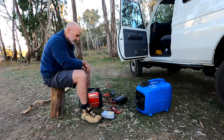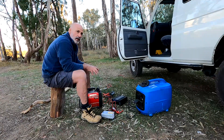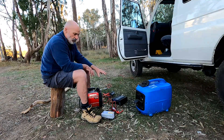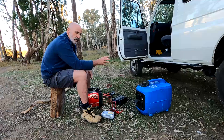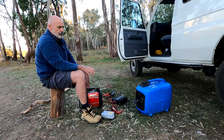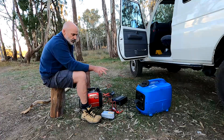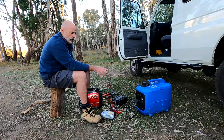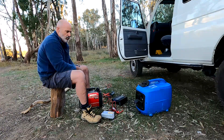This is a 20-amp garage smart charger — a seven-stage charger, so it's quite sophisticated. It massages your batteries, keeps them healthy, and you can leave your battery connected to it for 20 years and it will help that battery last a lot longer. The direct 12-volt generator output will just shove power in and keep shoving it until it boils the battery — nothing will stop it. The other downside is it's only producing five amps, whereas a two-kilowatt generator at normal operating output on the Honda and Yamaha hovers around 1,600 watts.